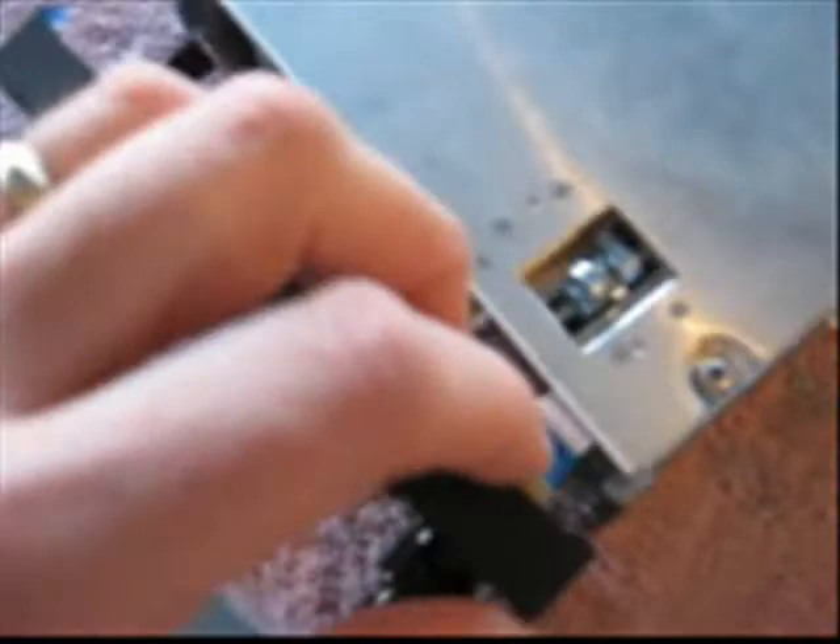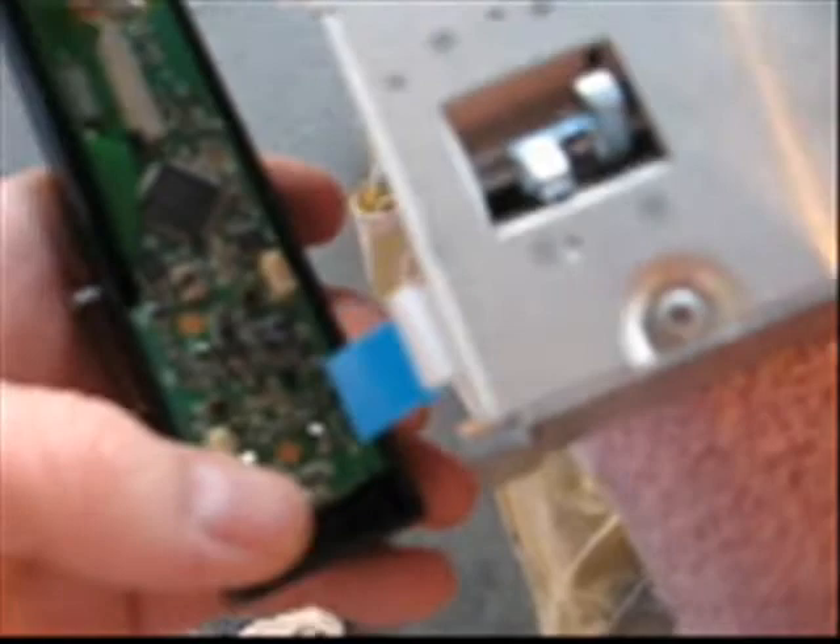I'm not real thrilled with that whole setup, but there you go. That has to get disconnected — you want to disconnect the cable, not the connector. You can see that in the rack I've already installed the wiring harness in the back and the cable connection. So we slip this baby in here, get them lined up just so, and then start cranking clockwise. That will pull the radio in. Then reattach the cable and tighten clockwise.